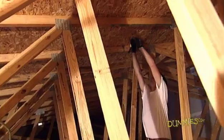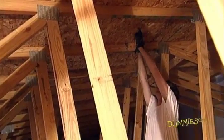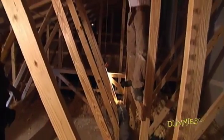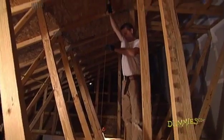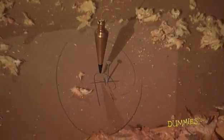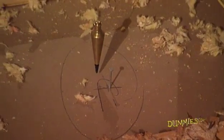To install a tubular skylight, go up in the attic. In between the rafters, mark the center of the tubular skylight by tapping a nail through the roof. Then, using a plumb line hung from that nail, mark the opposing center of the hole in the ceiling. A plumb line is a cord with a weight used to determine the vertical from a given point.